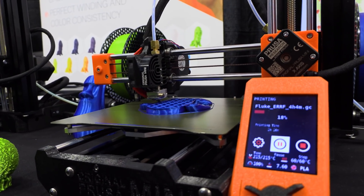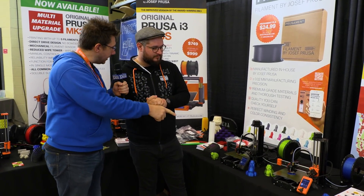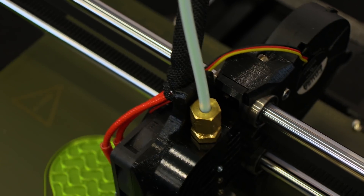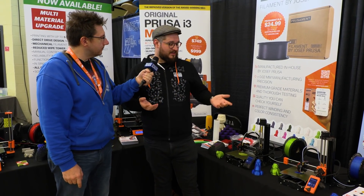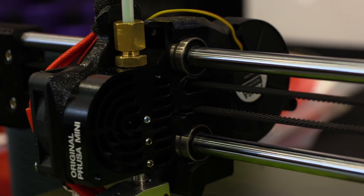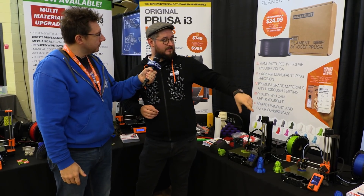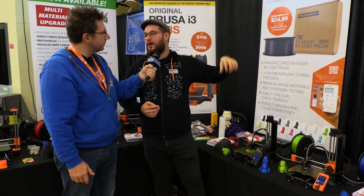Let's dive deep. This is now a Bowden setup, correct? Yes. If you want to make a printer cheaper, you look at the parts you can remove. We set the goal for the print size, looked at the printer and asked what we could remove and still make a great product. We removed the frame — the x-axis is supported from one side, but at this size it's more than okay. The worry is that a cantilever design could get droop in the x-axis, but we haven't found that to be the case, because the axis is supported by the aluminum extrusion and two 10mm rods.